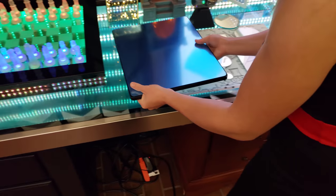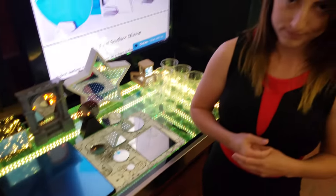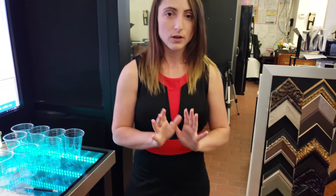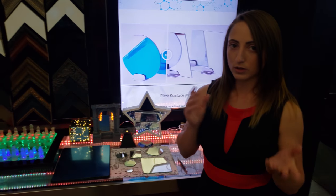Our quarter wave is tested on a six inch circle and has one wave per six inch circle, which translates to quarter wave flatness. The eighth wave is measured in a similar way. The biggest advantage with our flatter glass is if you need to go bigger but still need the surface to be extremely flat. In smaller sizes it's not that big of a deal. For instance, our one wave is really great for barcode scanning, binocular mounting, anything requiring a robotic part. If you're doing rear projection video it gets the job done, but if you need to reflect onto a large surface and get really great quality, that's where you might want to upgrade to the quarter or eighth wave flatness.